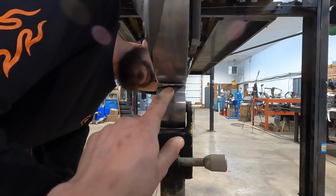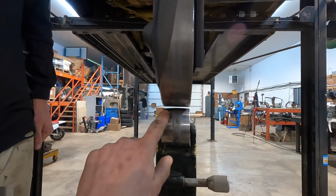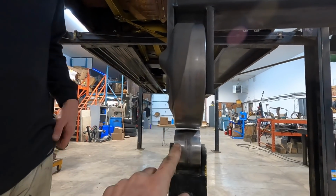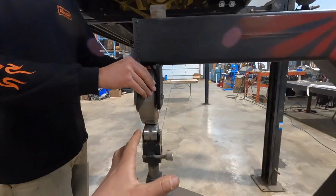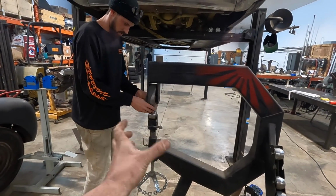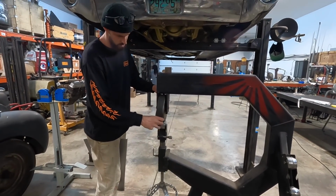So I'm just going to add to Jordan's point: whatever radius you've got on your lower anvil is what will directly press into the rubber and give you that radius. So he can choose whatever radius it is, and if it's a radius that's changing, you can also swap dies while you're doing it to go harsher.